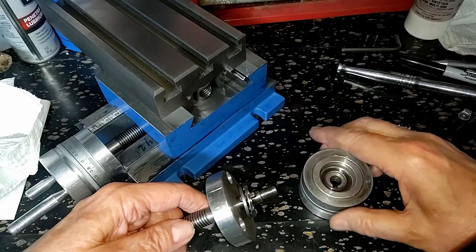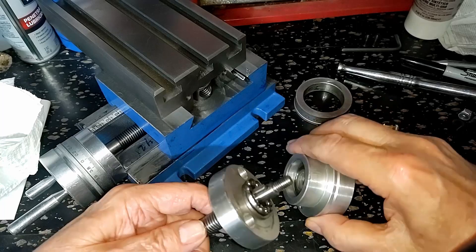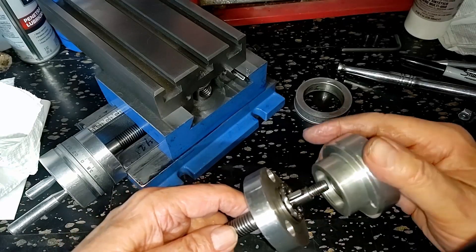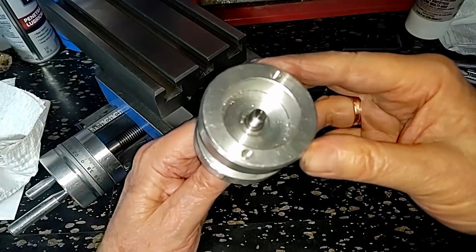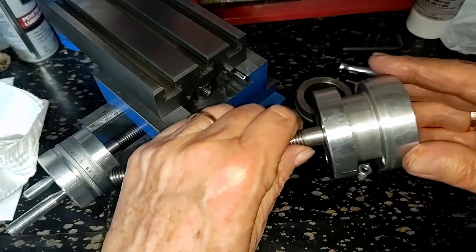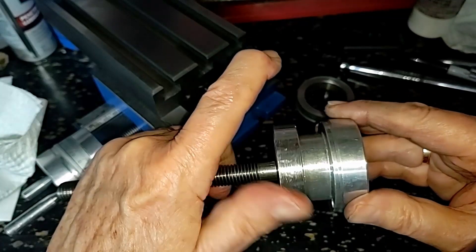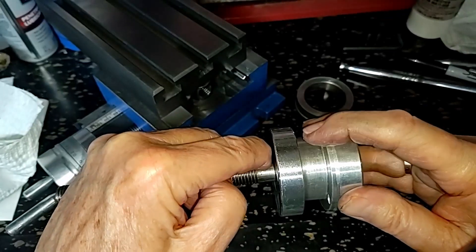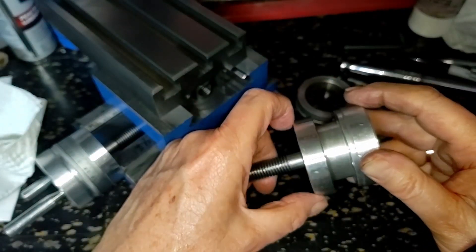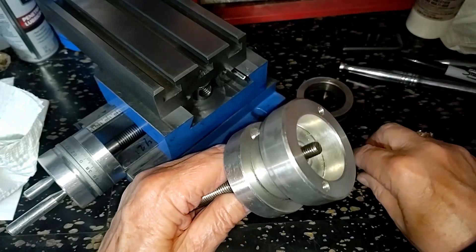Let's leave this ring off. I do like that magnet — the magnet's working out well. But anyway, we have another roller bearing here. Now that's assembled. And as you can see, there is a gap right here. So this ring is now running between this bearing over here, which is trapped by the shaft here, and this one over here, which is part of the shaft now because of the key.